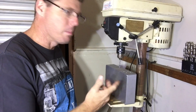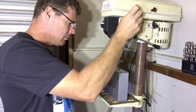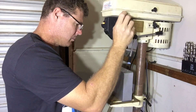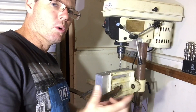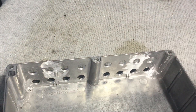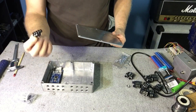So here I am in my workshop, just piloting the holes for the jacks to go in. With the smaller drill bit, the torque when the drill actually grabs isn't as much, so I can just hold it by hand. With a bigger drill, I don't like holding it by hand as much. Here I've ground off some of the internal protrusions that were getting in the way. I've worked out, based on where these switches are going to go and everything else internally, where I can actually put the input and output jack.